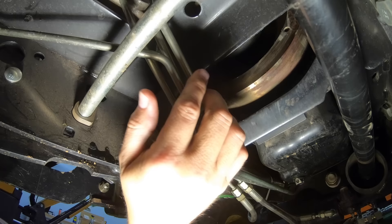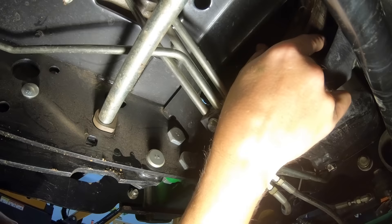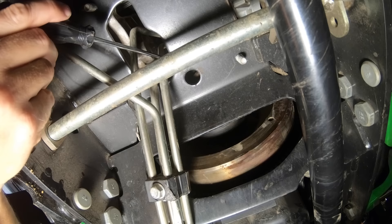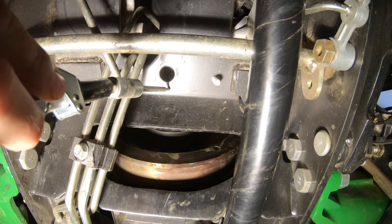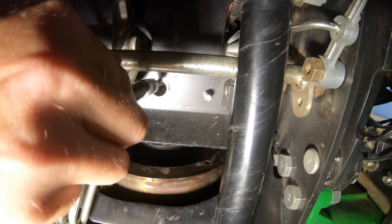We're under the tractor now and this is the flywheel of the engine. We need to turn this flywheel counterclockwise — you can turn it by hand although it's heavy. I push it counterclockwise until I see this hole matching up with that grease fitting right there on the universal shaft, the main engine drive shaft. I'm pointing at the grease fitting with the screwdriver — right there is the little ball we want to hit. I'll take my needle nozzle, run it right up through there, push that ball in, and I can feel it push in right there. I'm in there.